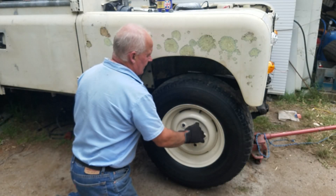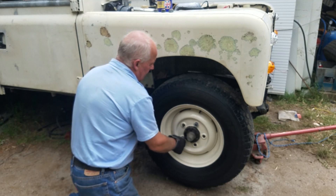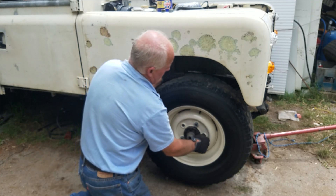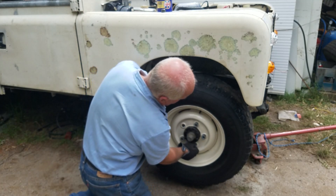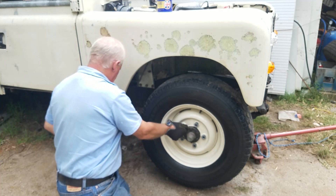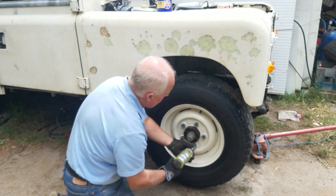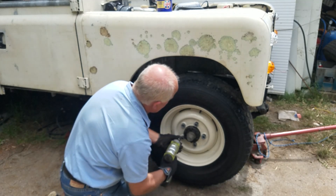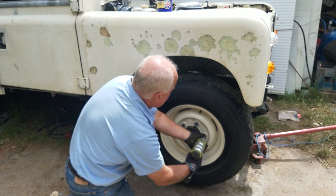My conclusions are things you won't find in other DIY electroplating videos. I can't get the silver shiny finish straight out of the solution, try as I might, but you can polish a shine into it, although it's quite labour intensive. By whacking up the voltage and the amperage with a 12 volt 6 amp battery charger, I was able to electroplate large items in complex shapes — an electrode on each side really makes a difference. How durable is the coating? Only time will tell — I'll let you know in a year.